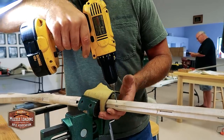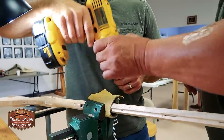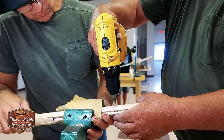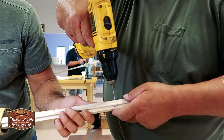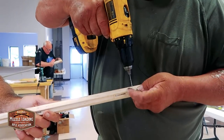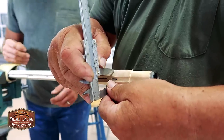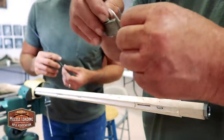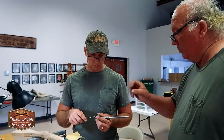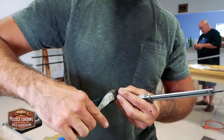It's all right — just freehand it. Now you've got pin stock. That's how thick it needs to be, outside to outside. I just cut it in there. What I want you to do is hook that little sander up and grind the tips round. You've got a jagged edge — when you push it through it's going to push wood out. One at a time, you've got to make four pins.